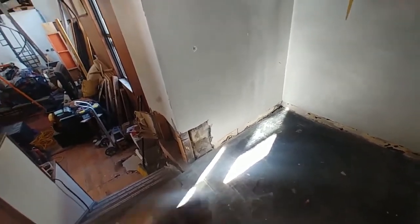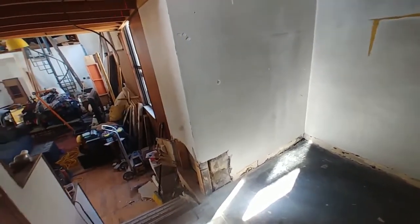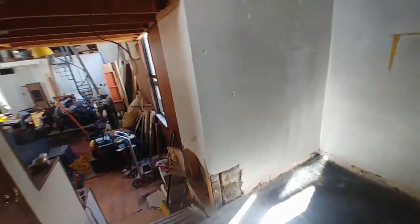We'll put a wall across here. We'll try to tie the washer drains and stuff, and we'll have to get water supply in the wall here as well. And we'll have to do so in such a way that keeps it from freezing again, because that's another big monolith of concrete that is an inside corner and just stands out in the freezing cold all winter long. So hopefully we don't get all these systems in these outside walls here and end up with problems as a result of the cold.